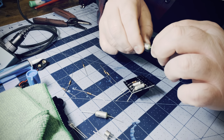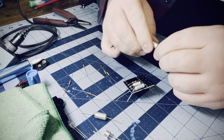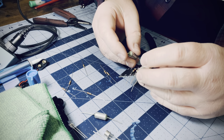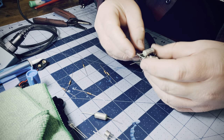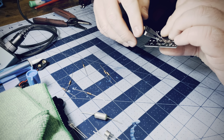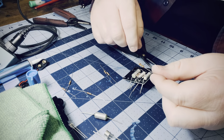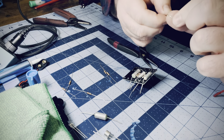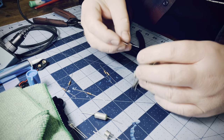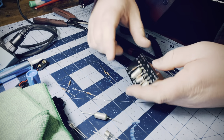Next we'll do the cap — same thing, I bend them a little bit offset so that they fit nicely in between. Next resistor is the 15K. I have gotten these mixed up before when I wasn't looking close enough — sometimes they look similar, or the order of the colors are just not exactly the same, but they're all the same colors. I'm pretty confident — that's 15K.